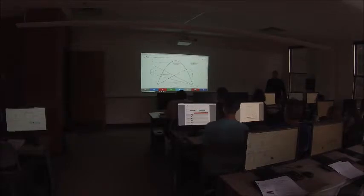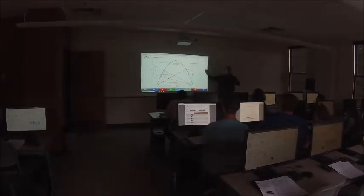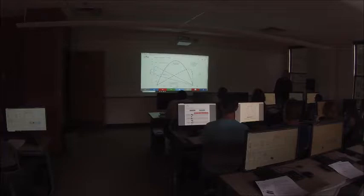Now, some industrial motor providers will only give you a slice of the graph. They won't give you all of it, because for industrial applications, typically, you don't really care much about what the motor does at low speed. So if you see a graph that doesn't look like it's complete, that might be why. But for FRC, you'll never run into that.